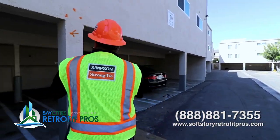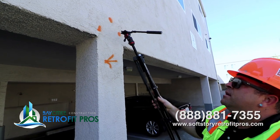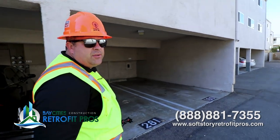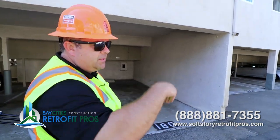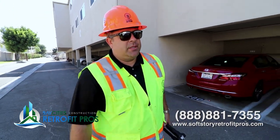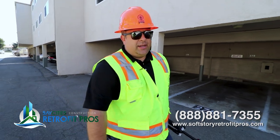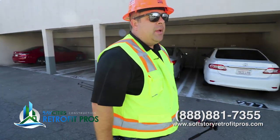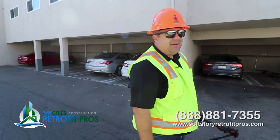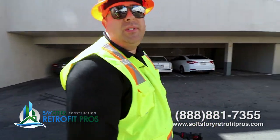By the way, if you see these little dots, it's my way of marking there's going to be a moment frame, and then this is the direction of the beam. That could change based on a few factors. If we find any infrastructure that's going to be in the ground within the footprint of the grade beam, we've got to move the location — because we cannot put any gas lines in there, and sewer lines can't be in the grade beam either. So it becomes problematic. Choosing where the grade beam is going to be is a very important part of this process, and that's why we have to open up the walls to make sure we understand what's in there.